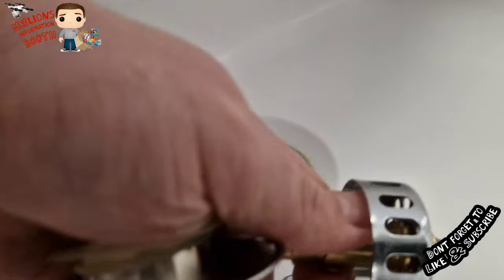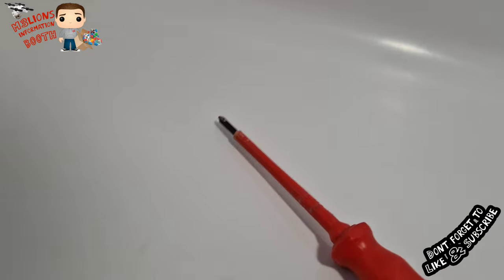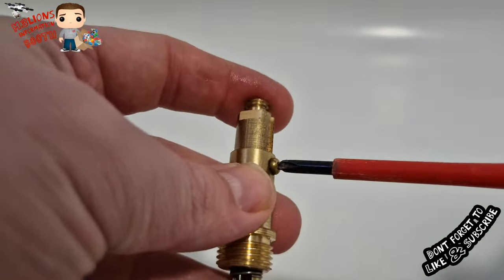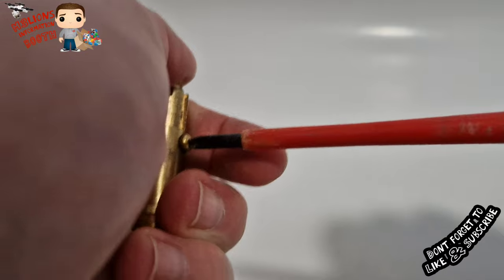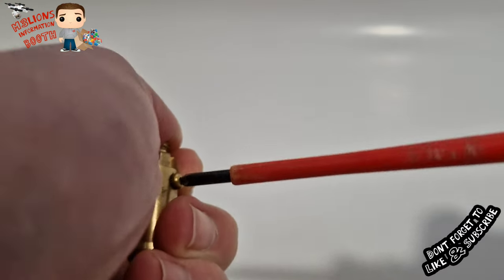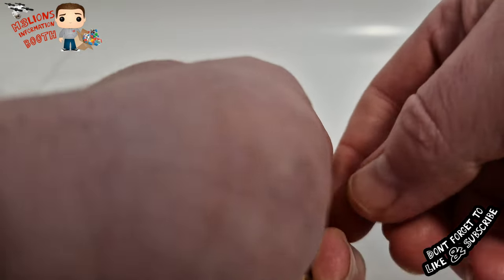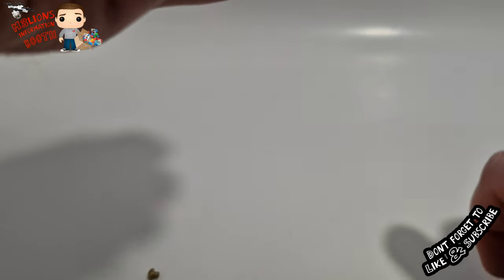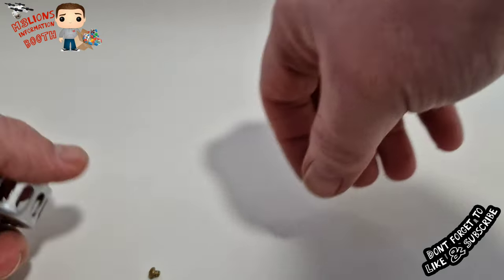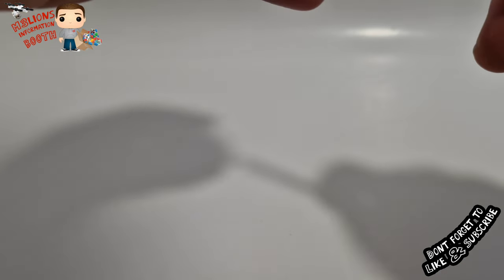It's got enough depth - let's just turn it aside and rest it in the plug hole because we don't want to drop the screw down the plug hole. Take the screw out and keep tension on it ideally, because then the mechanism doesn't go ping and fly away. There you go - click that down. It holds the mechanism in. Let's get this attached back on - it can sometimes be a bit fiddly.